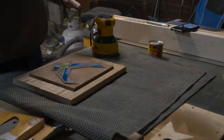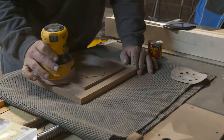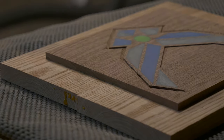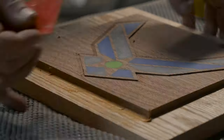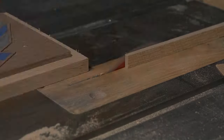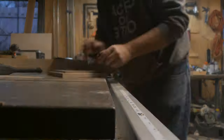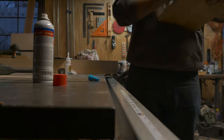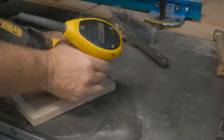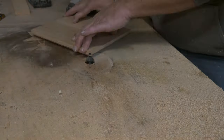I was really happy with that trick. Now I'm sanding because the colored epoxy was proud of the wood and I wanted it all down to one surface. I didn't get one edge quite right on the chiseling — went a little too far — so I filled it in with gap filler. Now I'm getting the final dimensions of the oak to what I want. I'm taking a block plane and chamfering the edges for a cleaner look — there was some tearout, so I ended up using my table router instead to put a 45-degree chamfer on the oak.